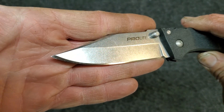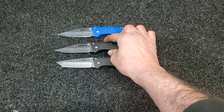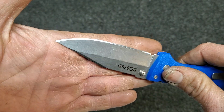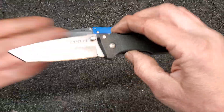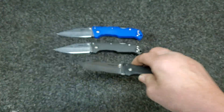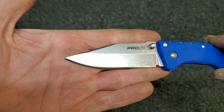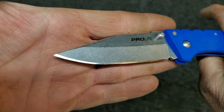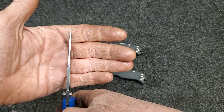The reason for 17 degrees per side is that these knives get very thick at the tip — you can see how bad the bevel widens out. Also, one of the primary grinds is off a little bit on Dave's knife. You can see here on the blue one how wide that tip is on one side, and the other side isn't so bad.